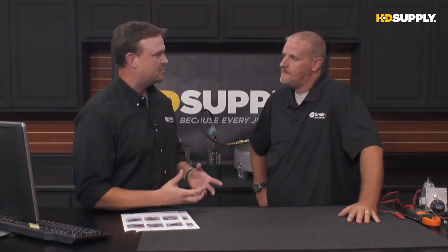Door switch is not tripped. I'm producing more than 10 millivolts on the thermocouple. Then I would look at changing that gas valve. Yeah, and you would do that test if your pilot didn't hold and your thermal switch didn't trip.